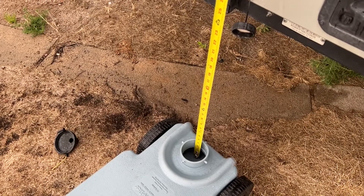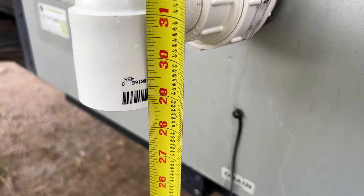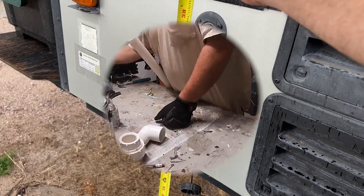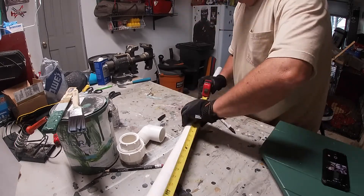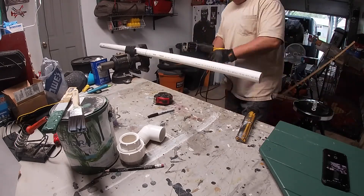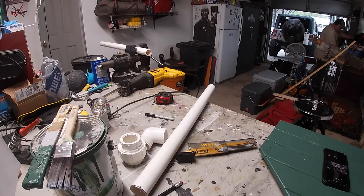I'm about half an inch off the bottom of the tank to make sure we get maximum drainage out of it. And I'm measuring about an inch up into that elbow, which is how far that straight piece of pipe is going to go. In my situation, we're looking at about 30 inches. Now for the easy part — we've just got to put all the stuff together. So I'm taking that straight piece of pipe, measuring my 30 inches, marking it, and sticking it in the vise. I'm going to cut that piece off with my reciprocating saw using a wood blade. Really from here on out, this is no different than any other PVC project you've probably done at your house.